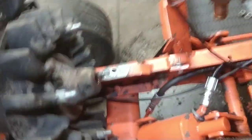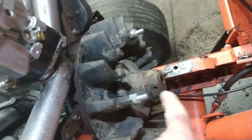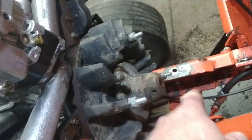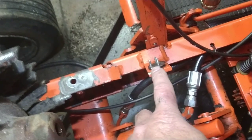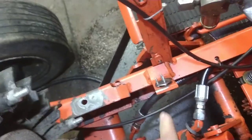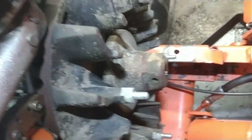This one's getting redone because the set screws were backed out and not properly torqued, and the pump shaft was wiggling in here. The so-called mechanic bolted the torque arm into the snubber plate and that lasted all of one second before it broke loose. I have a new adapter and new torque arm on order to fix this tractor.